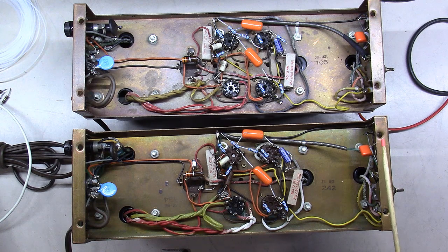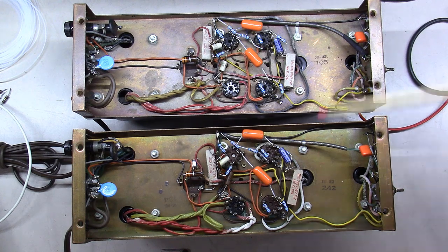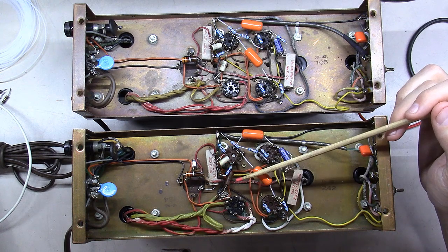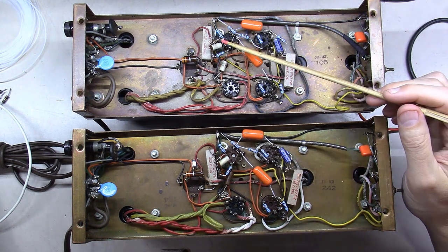And these units were designed to run back in the day on 110, 115 volts. Now we're pushing 120 volts coming out of our wall outlets. And so every little bit helps the life of the transformers and whatnot. The only other thing I would call out here is these little capacitors of this type rarely go bad, but I've ordered some new ones anyway.